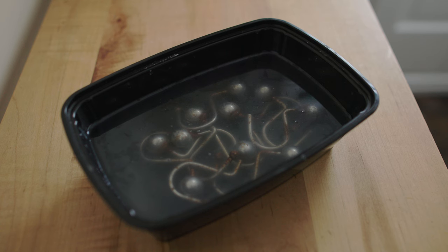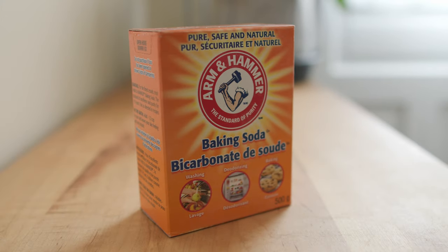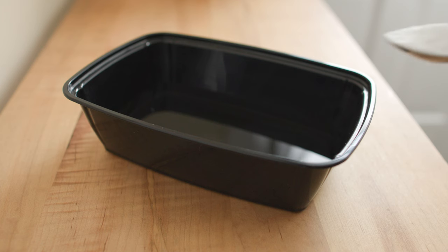These hooks have already been tested — I know they're good. Since they're a low-value item, there's a lot less pressure. Now that I'm done soaking, the rust has really greatly diminished. The next step is to neutralize the acid that has been eating away at the outside of the metal — I want it to stop now.